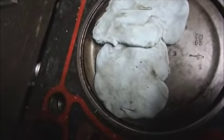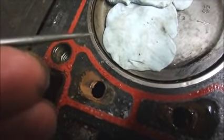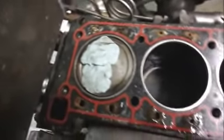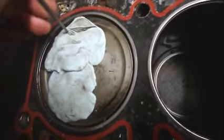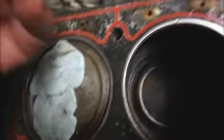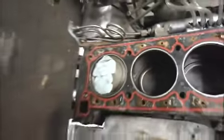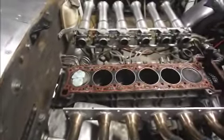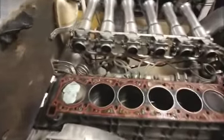So all in all, there's no exhaust valve marks at all. So I think we're miles away. We've got that much, 4 or 5 mil. So because these pistons are dished, I've obviously got away with taking a darn sight more off the head, well, 10 thou more off the head. So that's a big relief. Now I can put it all together again.